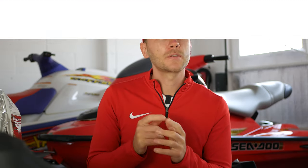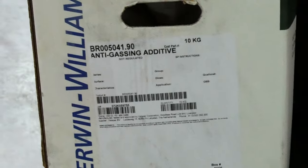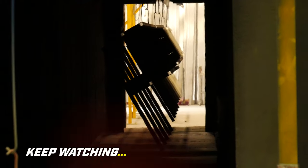Are you still following? Plus, there is an additional step which most competent powder coaters will use, which is an adhesion step, which is essentially a first coat to the actual substrate. It's then baked to gas out again. You're becoming familiar with the gassing out process. Sounds quite crude. Then it is actually powder coated. So there's a bit more principle, if done correctly, with powder coating over galvanization than automotive spraying.